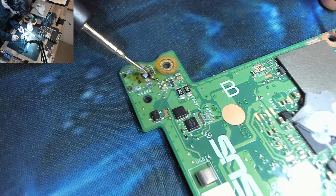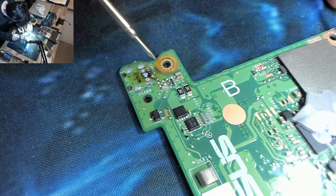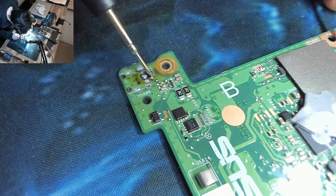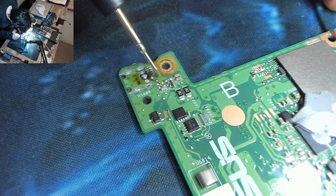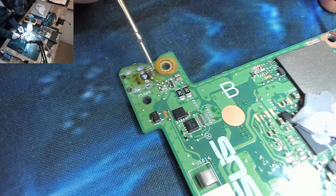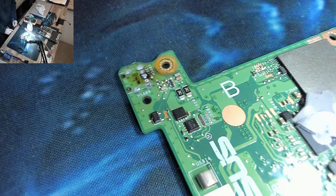So we possibly need to dig that short out or disconnect this area. What I'm tempted to do is scratch through here and just disconnect that trace from the burn mark. The problem is there's a via there and I don't know where that goes to. So we might just have to go no guts, no glory — cut across there and see if that cuts off our short circuit. And if it does, we can poke the DC pin out and just run a wire to it to jump over the short. Let's try that and see if it gets us anywhere.